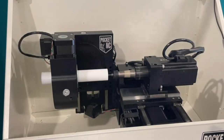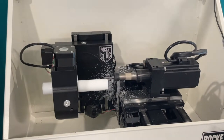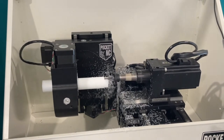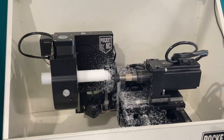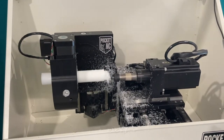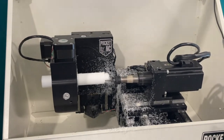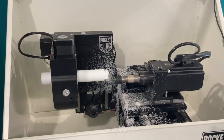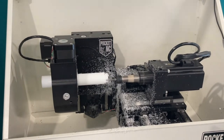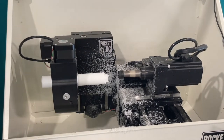The part we're making today has been designed in SOLIDWORKS and programmed in SolidCAM to get the NC output. As you can see, for the first operation, we're going to rough with SolidCAM's iMachining technology. This is so we can get as much material out as quickly as possible. Then from there, we'll use simple facing operations, profiling, and then finally five-axis motion to clean up the part so we get exactly what we want to have.